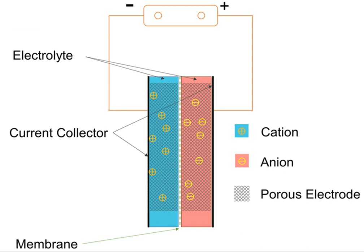Research into electrode materials requires measurement of individual components, such as an electrode or half-cell. By using a counter-electrode that does not affect the measurements, the characteristics of only the electrode of interest can be revealed. Specific energy and power for real supercapacitors only have more or less roughly one-third of the electrode density.